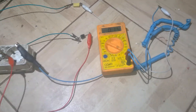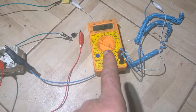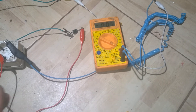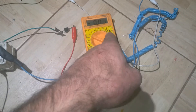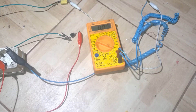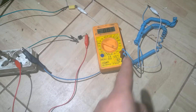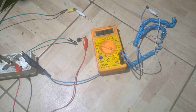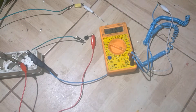What you saw was the capacitor charging up — you saw the voltage spike and then it immediately came down to zero. This is what you want to see: the capacitor charges, and once fully charged no current flows and no voltage appears on the meter. If it takes too long to charge, or if it doesn't go to zero, the capacitor is leaking. Even at 100 volts a leaky 630- or 500-volt capacitor will show it. Generally it takes one or two seconds to charge — more than that, replace it.